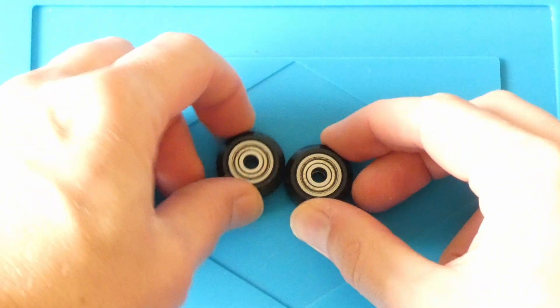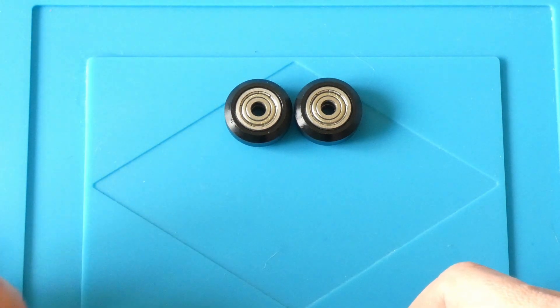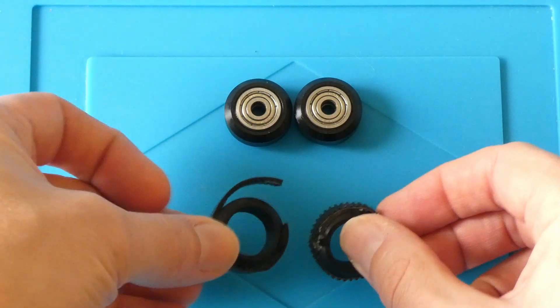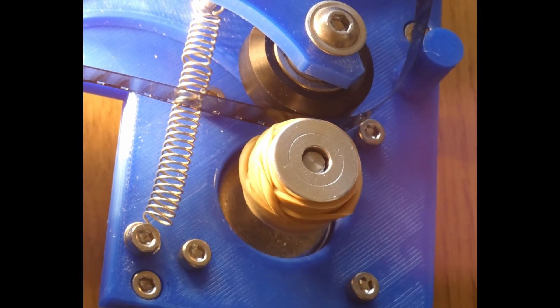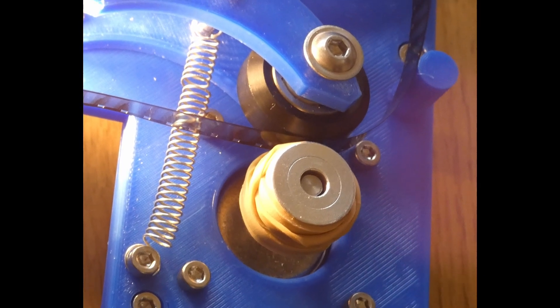The main roller mechanism where the film feeds through is known as a pinch roller. I originally thought that two nylon wheels would work, but the film just slips through them. I tried gluing a rubber belt to the wheel, but that just slips as well. I wanted a soft rubber roller. Unable to find anything suitable, I ended up wrapping a large rubber band over the gear. Amazingly, it worked really well in the tests I did.